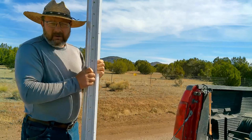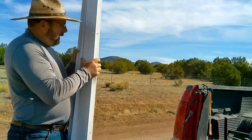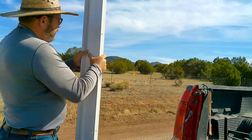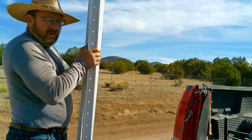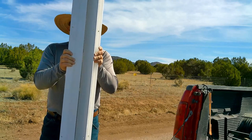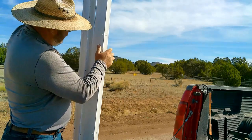This is the way they're supposed to be bolted together at a 90 degree — one direction going that way, one direction going that way. What we have here is one going this way at 90, and the other one is actually going to be facing this way. It's not going to be a 90; it's going to be more of a split. So I'm going to put the hinge on the back side of these two right here.